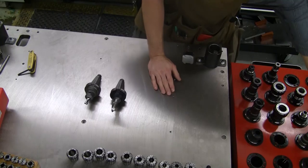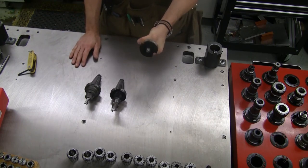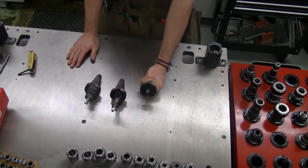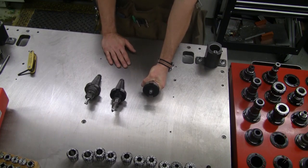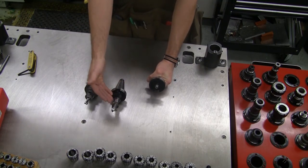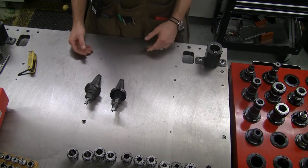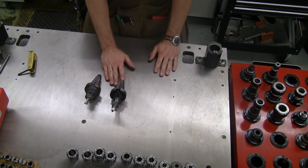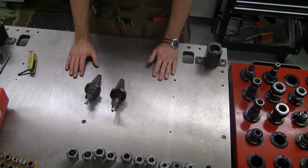Some of the smaller holders — for instance the one for an eighth-inch tool — have a very small set screw. To achieve reasonable speeds and feeds with an eighth-inch diameter tool you'll need to spin it at faster RPMs, but deviation is somewhat allowed at that point because cutting forces are much lower on a small-diameter tool versus a half-inch or one-inch tool. In general, I would recommend choosing end mill holders for roughing work, with larger tools at 5,000 RPM and lower.